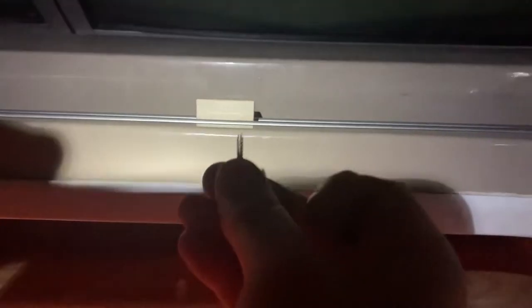I've considered removing the entire helm but I do not want to do that. So what I'm going to do is drill a hole straight down through the block, big enough to fit the head of this screw, then slide the door over on top of it, and from the bottom just screw my block back in. The original holes are probably stripped — that's why they fell out — so I may drill some new holes from the bottom, then put the screw through that hole, through the track, and up into the door.